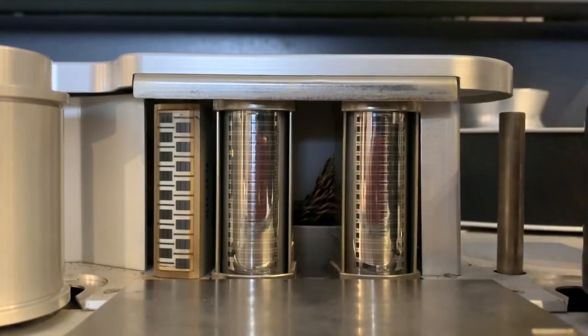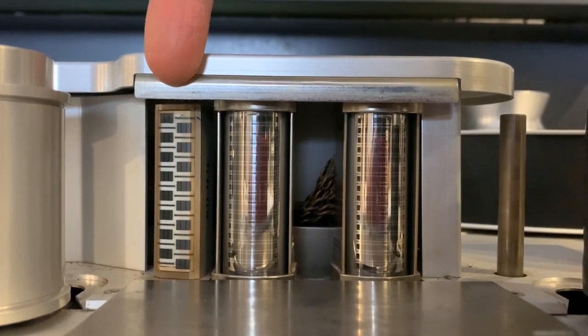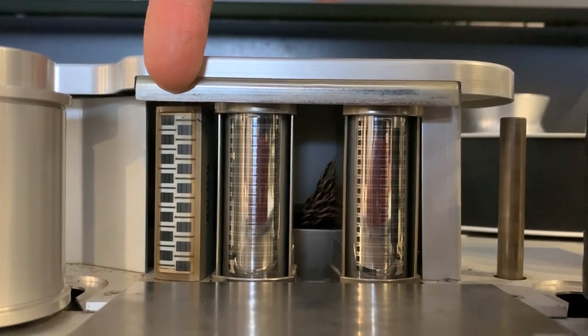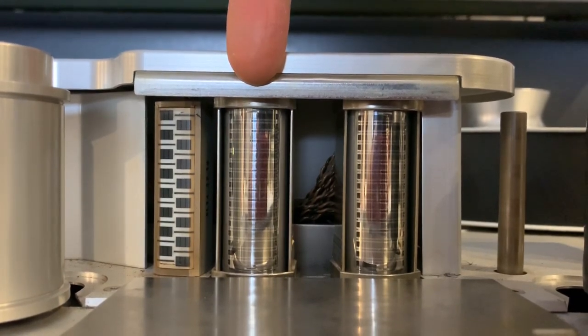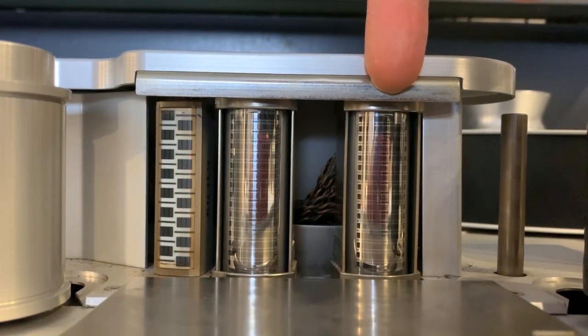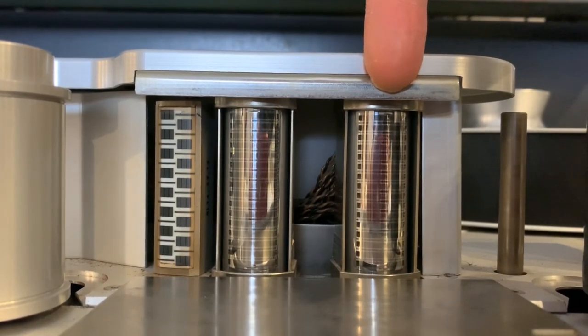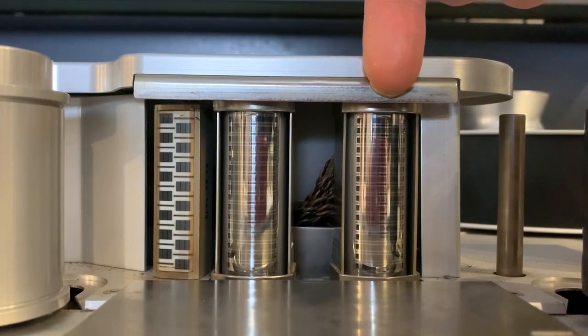As you can see, we've got three heads. This is the erase head, which erases what's on the tape on the particular track you're working on. This is the record head, which will record to whichever track or tracks you've selected. And this is the reproduce head, or repro head, which will translate the magnetic flux recorded on the tape into voltage so that we can play it back through speakers or mix it on the mixing desk.